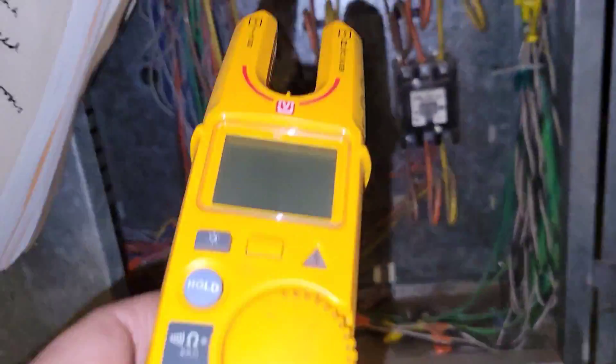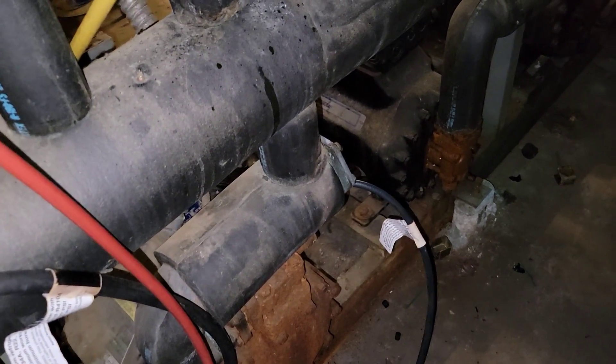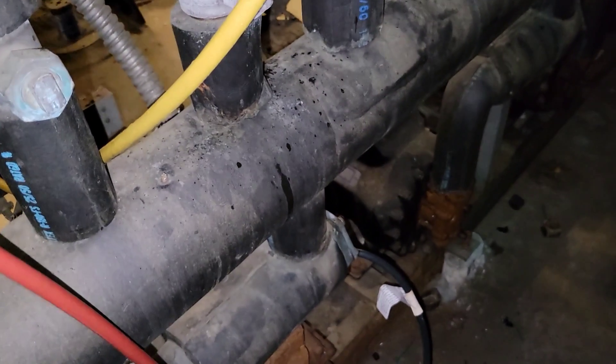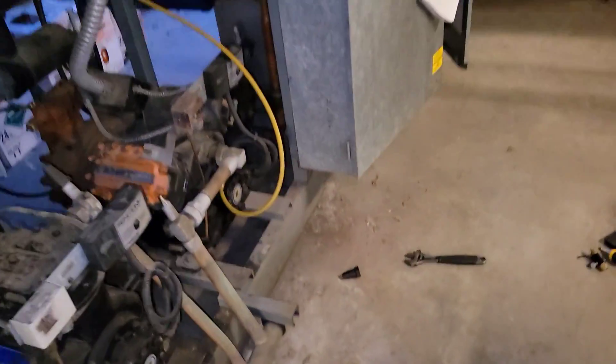There's no better way to check voltage than physically at the actual breaker. Checking it now — we've got 485 volts. The oil is out of the compressor, so we're going to unhook everything, open up the discharge and the oil line, and partially open the suction because I don't want the oil to rush back in. Unfortunately putting the oil return there was an error on my part — I should have put it over there to let the other compressors gobble it up. Anyway, we're going to try to stage it on and see what happens.